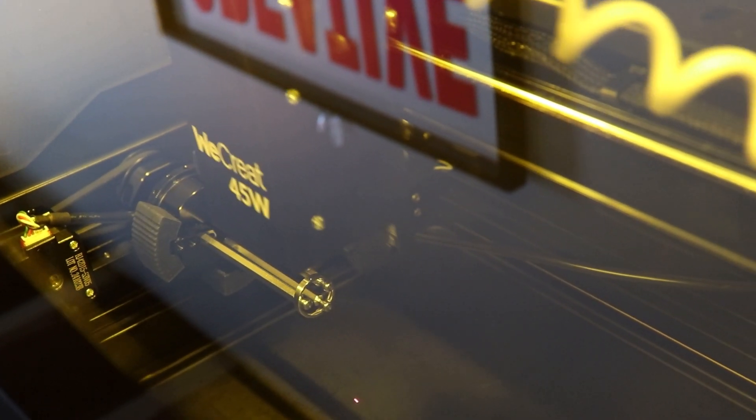There are some cool accessories for this machine. It is a 45 watt diode laser but you can easily swap it out for a 2 watt IR module. An IR module is not for cutting — it's for engraving only and it allows you to work on raw metal like gold, silver, titanium, platinum, and plastics. It operates at a different wavelength that the diode just cannot do. So between the diode and the IR you can engrave on just about anything. There's also a rotary attachment for round items from something as small as a ring to a large 40 ounce tumbler, and a pass-through attachment for really long wood signs.